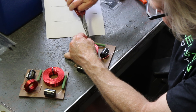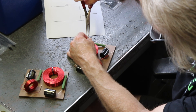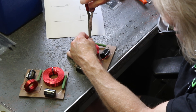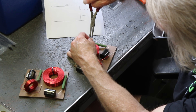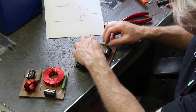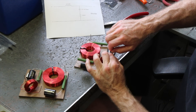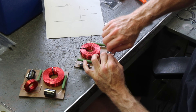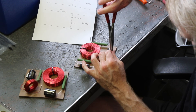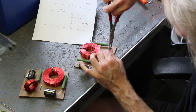That's going to be the output to the woofer circuit. The connection really is the twist — that's the connection. The solder is basically just holding the connection together. The connection is that it is point-to-point wired and twisted together. You have to be careful with your twisting — you don't want to twist so hard that you twist the ends off and break it. That does happen and I end up mailing replacement capacitors or resistors. Don't twist so hard that you get down to the end and pull it out.